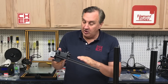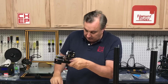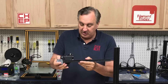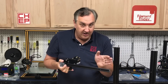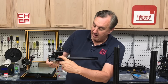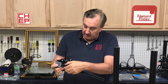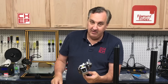The next step is installing the aluminum extrusion to the bracket that has the extruder motor. There are two screws that hold it in place — they're hard to get to and you can only tighten them through the holes in the bracket. I put them in but don't tighten them all the way so I can adjust it to be perpendicular to the rail — a perfect 90 degrees. If you line it up flush with the edge of the bracket, you'll be very close. Then tighten them up with the allen wrench.